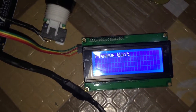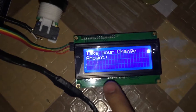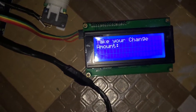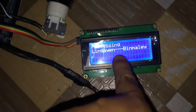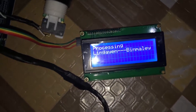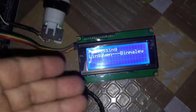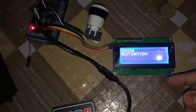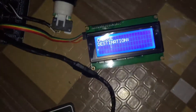The system will place a wait once it reaches the 16-peso target and then calculate. It shows 'take your change' and displays the amount on the LCD. I added a long delay for the purpose of presentation — in the final version it will be fast. As you can see: 10-peso coins: 0; 5-peso coins: 0; 1-peso coins: 4. So 4 pesos is the change. Then it signals the driver — data is sent to the driver's side.